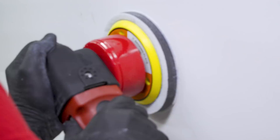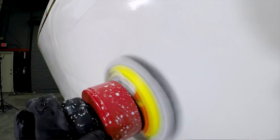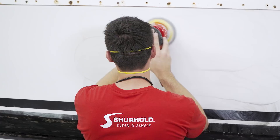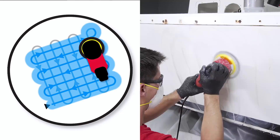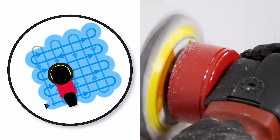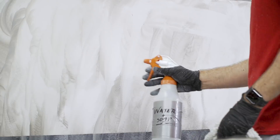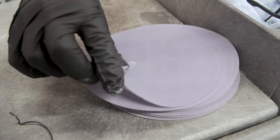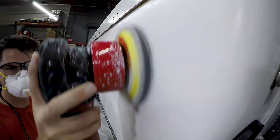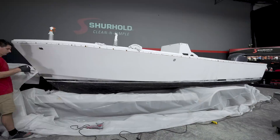The most important thing when wet sanding with a dual action polisher is to keep the tool moving. The random orbit provides the best finish when using the proper movement — do not use a circular motion. Work the tool in a two-foot square area, moving forward and backward in an overlapping parallel linear motion, then repeat in an up-and-down motion. Use just the weight of the machine on horizontal surfaces, or light pressure on vertical surfaces. Constantly lubricate the work area with your spray bottle of soap and water to prevent pad clogging and burning. Replace sanding pads regularly as they become dull. Wet sand until the work area has an even, matte dullness — you're removing dead oxidized gel coat to reveal the fresh preserved gel coat underneath. If the slurry gets too thick, rinse, check your progress, and continue as necessary.